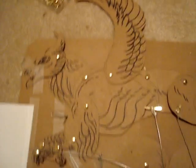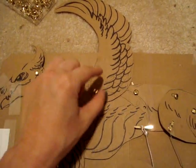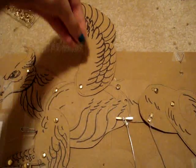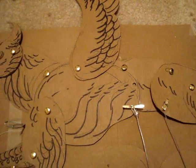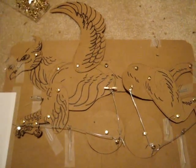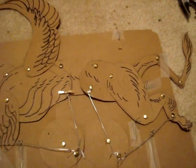I felt like I came up with something kind of clever and I'm forgetting what it was — oh, I know. I think it was something like: if I leave his wing fixed but have sort of a bottom part of his wing and have it insert into his back, then as his torso goes up and down his wings will flap, and I won't have to have that weird bumper on the cam. It should just sort of happen more like the way that they make wings flap in a pop-up book. So I think I can use some of that same methodology here.